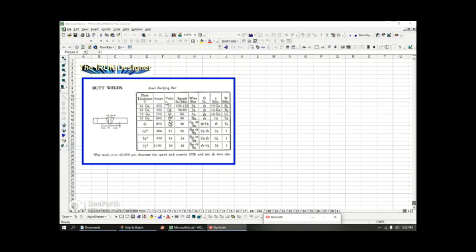They're running 900 amps, 33 volts. Remember in the previous slide, we said, well, what about 300 amps? But what you need to look at is, whew, look at this speed in inches per minute. These guys are flying down that weld gap, 26 inches per minute. That's more than 2 feet per minute, which is between 13 and 24 times faster than manual welding. And they're using enormous weld rods from 3/16 all the way to 7/32. Remember, we said that was almost like 0.22 diameter.